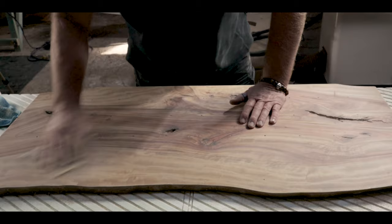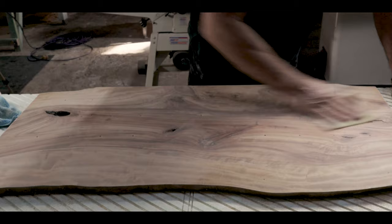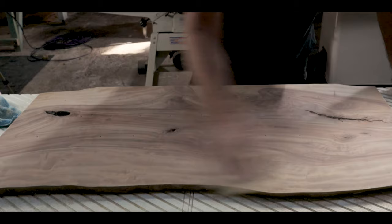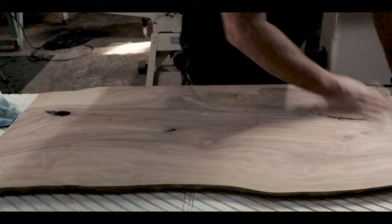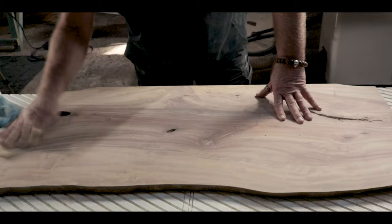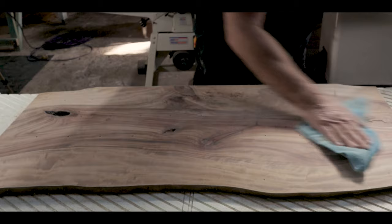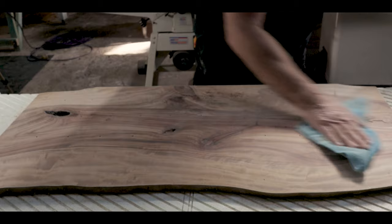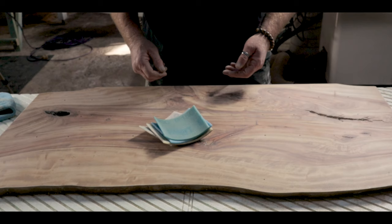Same deal, just a light sand. Just beautiful grain on this camphor laurel. Now the reason we're sanding to this degree is for two reasons. One is it allows the electricity to go through the grain and give you a better burn. But more importantly, at the end, when you have all those fine tree-like, branch-like figures going through your wood, when you put your final finish on, you don't have to sand as aggressively and therefore you don't lose any of that fine detail. So we're going through our grits now: 500, 800, 1000, and 1500.